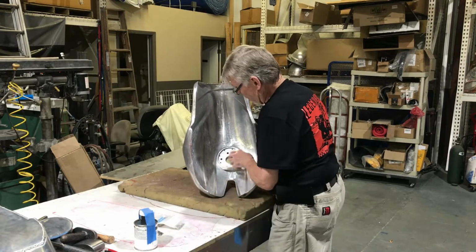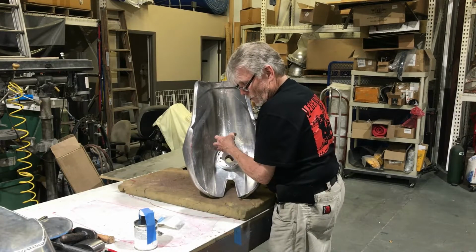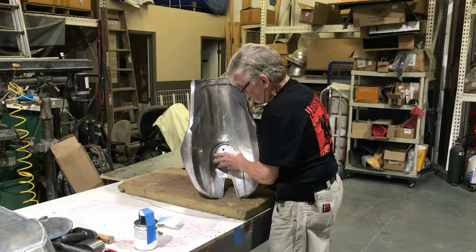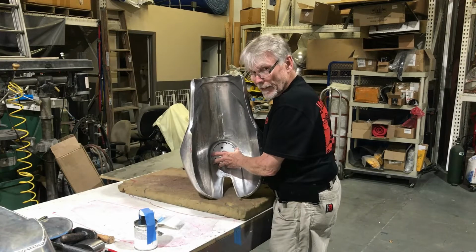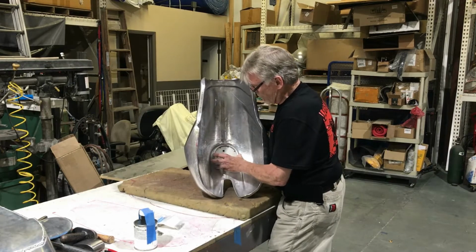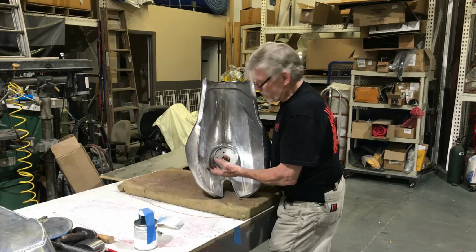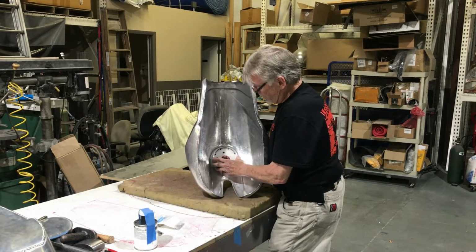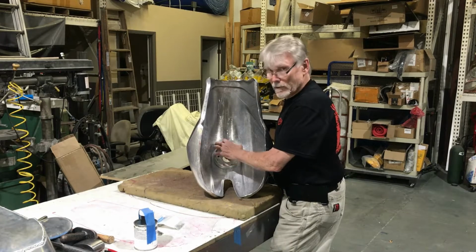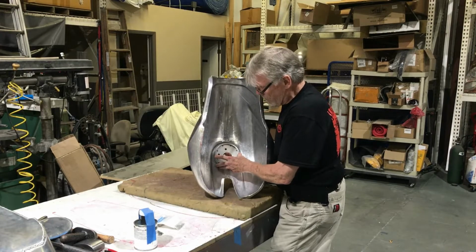And then we have 8 5mm bolts that bolt these together, and as we tighten it up, it forms a bend. It rolls a bend around the opening where these two join, and it traps the aluminum in between them like a gasket, basically. And wherever it isn't making good contact, the sealant kind of makes up for that. So this is the way we've been doing them for years, and it really works out well. You don't weld the top of the gas tank to this ring. You could, but you'll get a lot of warpage, and you have to do a lot of post-processing on it. So this is how I do it.